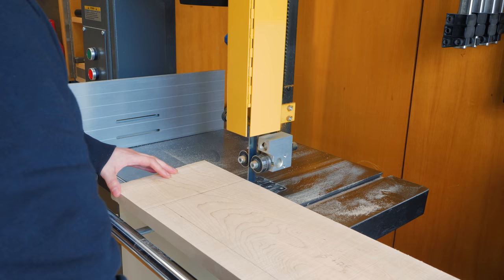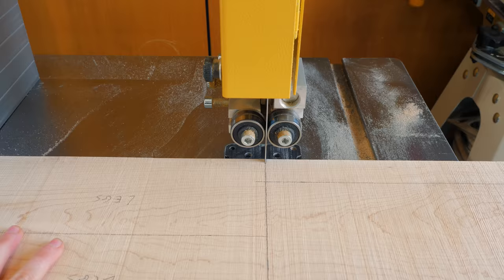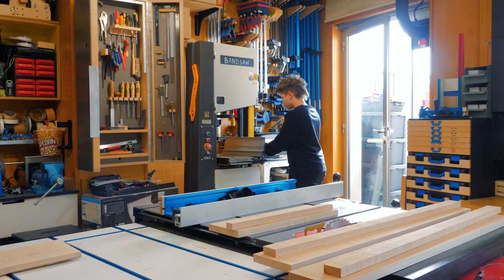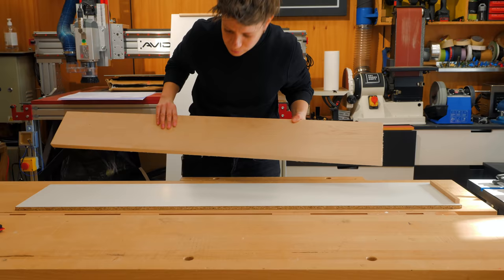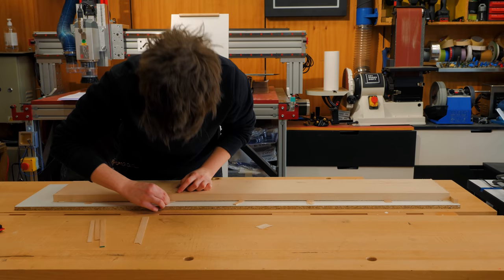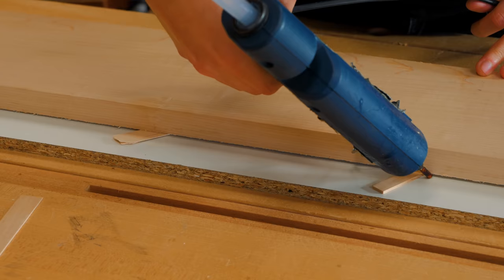This thick piece of maple was very flat and well acclimated to my studio, but after resawing, the boards warped. I'll deal with that in the following steps. I started by cutting the parts close to their final size and flattening the longer boards using the sled method for the planer. My jointer is super small, so this trick is what I typically use to flatten boards that are longer than the jointer's capacity.